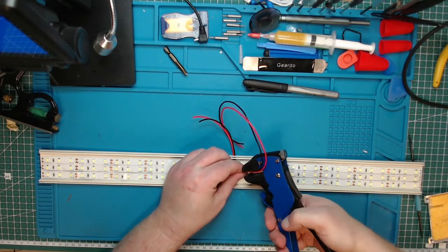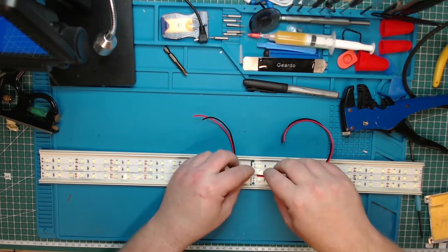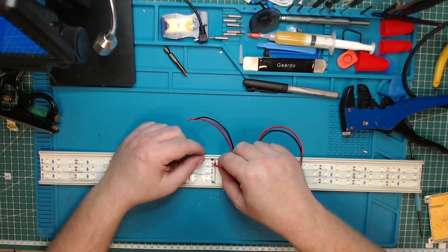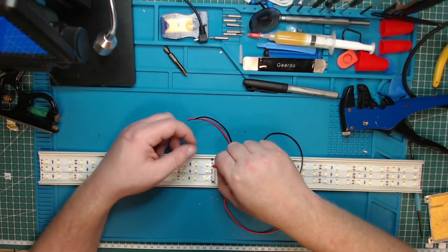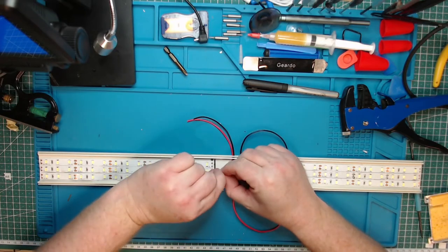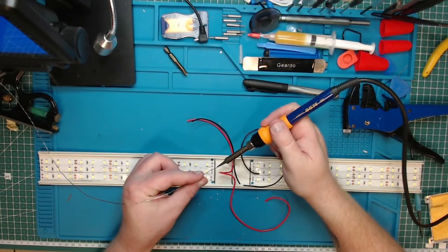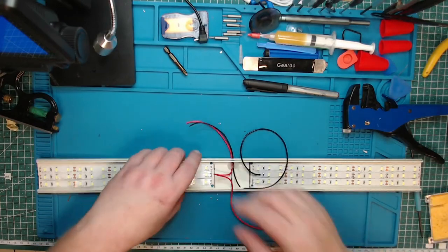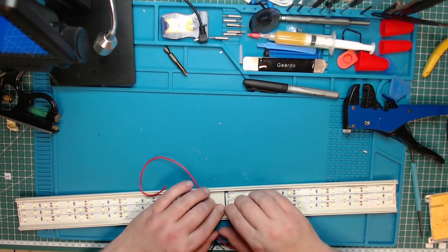One of the things you can do with these wire strippers is strip back just a little bit of the insulation, like so, and then we can give it a bit of a twist. That's going to give us just enough to get our solder onto, and then we can move on to the next one and keep going like that. So I think we might need to tin that. Where's my solder? And my soldering iron. We'll get it somewhat where we need it to go.